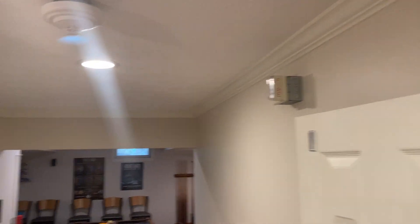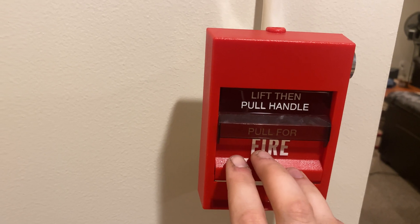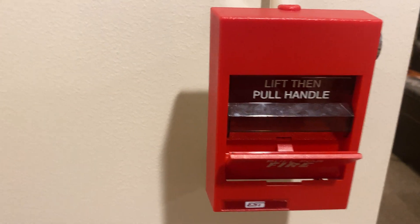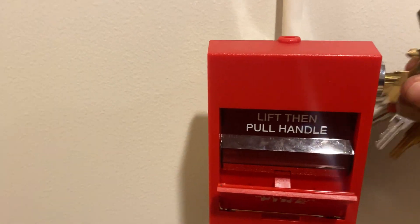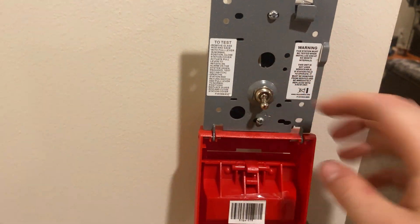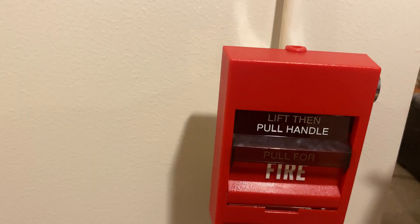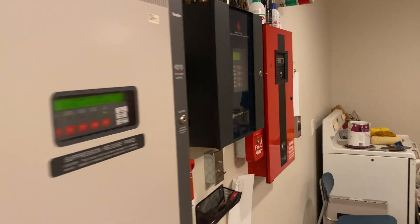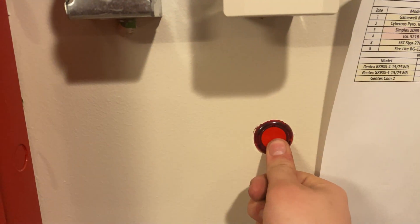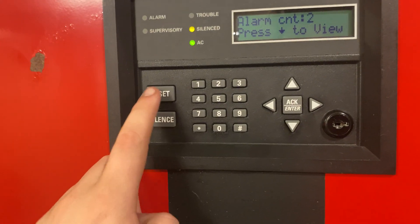When we got the panel alarm, we can go ahead and pull the EST pull over here. In three, two, one. Reset this - we'll take our CAT45, switch down, fold the flaps back in, up, and then lock. Silence from the external silencer, and then we'll go ahead and reset from the panel.